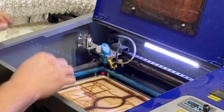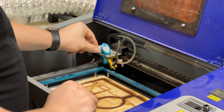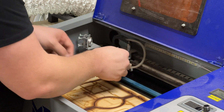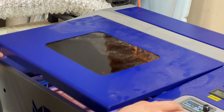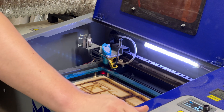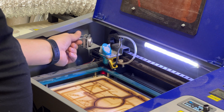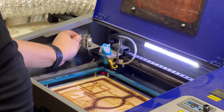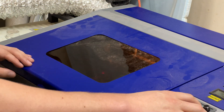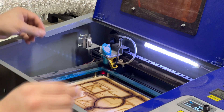Now we're actually walking it a little bit differently. So I'm going to swap this out, turn the laser off, and swap this tape over so that way we have a new piece that we're looking at. Now we're going to see exactly where we're landing — it got a little blurry there with how many lines there were. We are now much closer to the center. We're going to tighten this top one a little bit, and that will move the laser over a little bit, and that should help us center right up. And now we are in the center.